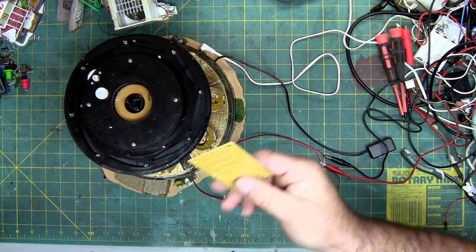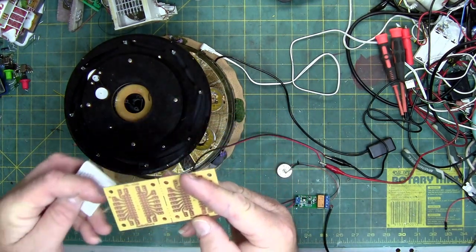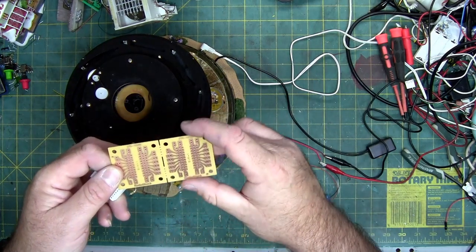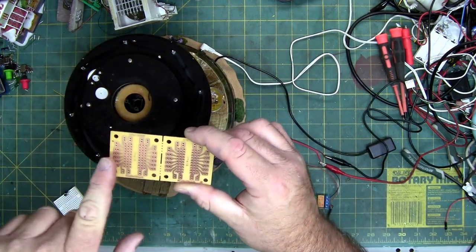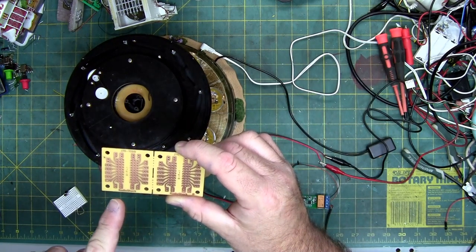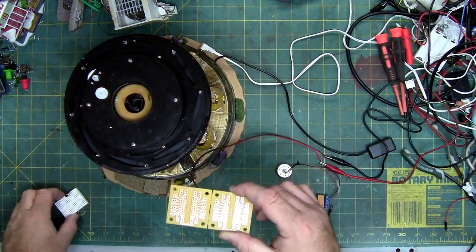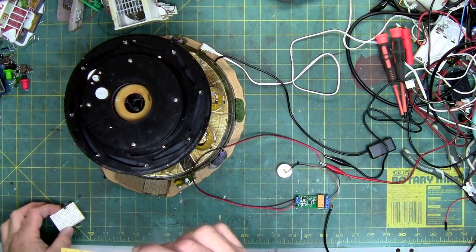You've got to be careful because sometimes you get boards like this where there are connected tracks — everything on this side is connected and everything on this side is connected, so hot and negative. This can also work for you. If you're building a light circuit, you can solder all your components across what you need, but if you're trying to solder a resistor to a light wire, the resistor has to have the light wire soldered to the end and it won't sit flush.